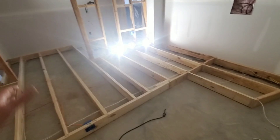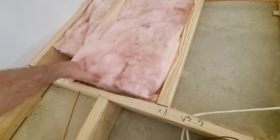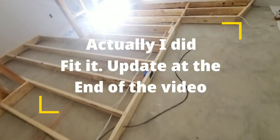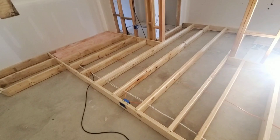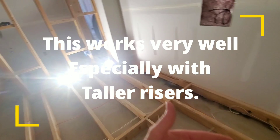Don't use rock wool for this application — I know guys out there are doing it, but don't follow everyone blindly. It's a waste of money and not as effective. You just want to lay the insulation in gently — see how thick it is — and you don't want to compress it. Of course I've got some cables and stuff in here so I'm just going to lay the insulation on top rather than cutting it to fit on both sides of the wires. It's going to work very effectively.